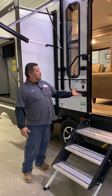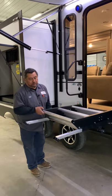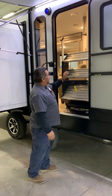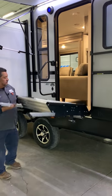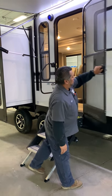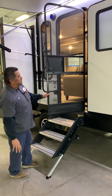You've got a grab handle here which is going to lift up and rotate — you could also rotate it over the door if you wanted. These are your steps, which you'll be able to adjust by pulling a pin out here. As they rotate up they go in, and you just unlock it here. The biggest thing on these steps is, once you're down, make sure this is down and tight for your door to clear. Otherwise if it's up your door is going to hit, so it's got to be all the way down — that's where you get the adjustments.